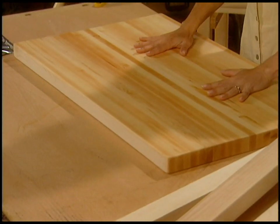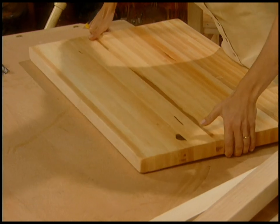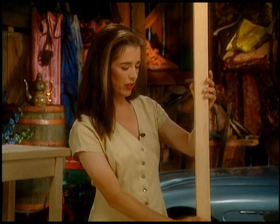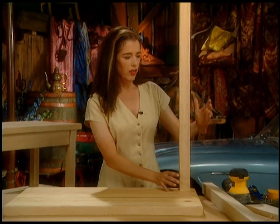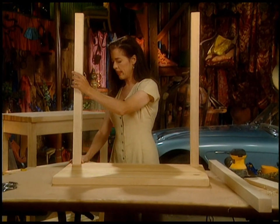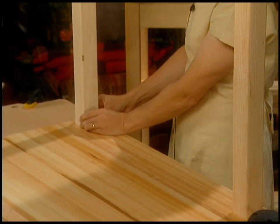To start with, I'm going to put this upside down because I'm going to mount the legs on the bottom. Okay, let's all calm down - I'm just really excited, I really like building stuff like this. So you take the legs and put them up in the positions they're going to go, because you kind of need to eyeball it and see if it looks right. You want to inset the legs maybe an inch or so - I didn't quite do it enough on this one so I'm going to set them in a bit more.